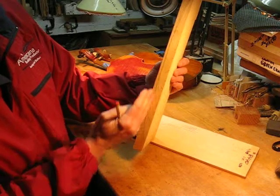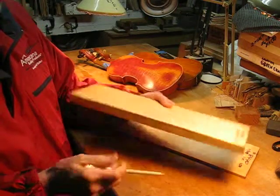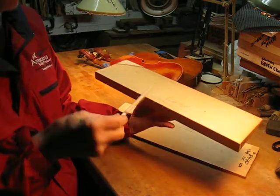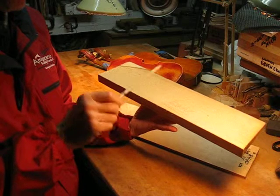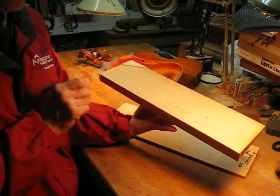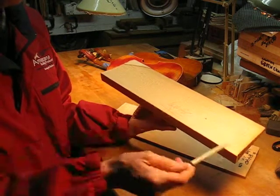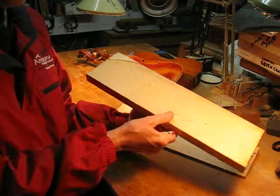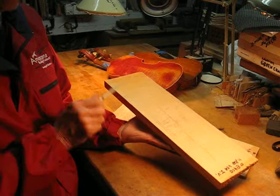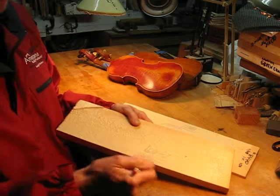As the tree's growing, the grain's running over here and making a little wave. If you turn the piece over — I'm just supporting it on my fingertips — it's just the opposite: it's brighter at the ends and not as much in the center. So once you find where it's high in the center, mark that side up. Flip to the other side and mark it down.